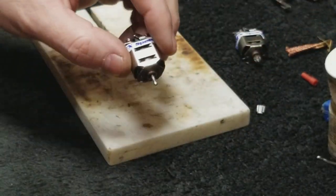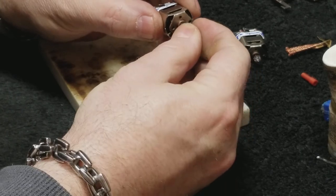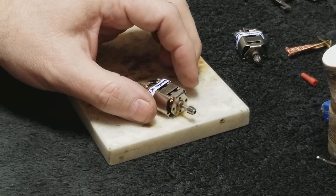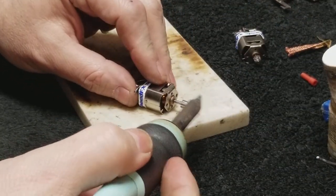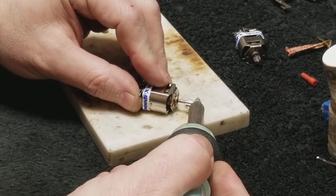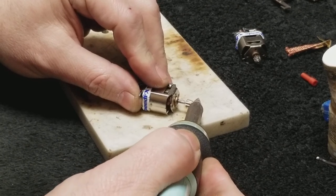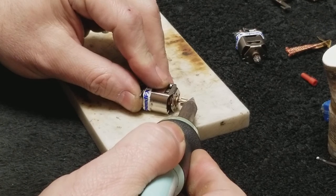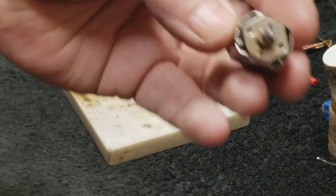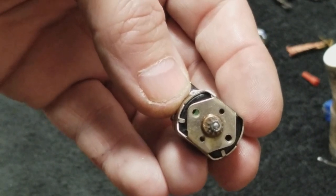You can see the solder tinned on the shaft, and where it stopped and didn't stick — that's okay because you want to keep solder away from the bushing as well. Now put some more flux on and stick the pinion on. It'll just sit there — you can't push it all the way on because you've got a layer of solder. Wipe the tip nice and clean, hold the iron on the end, and pretty soon you'll hear it sizzle and see the solder start to liquefy. When it liquefies and gets hot, it flows down. Don't touch it — let it cool. Then you can see solder on the shaft and around the end of the pinion.